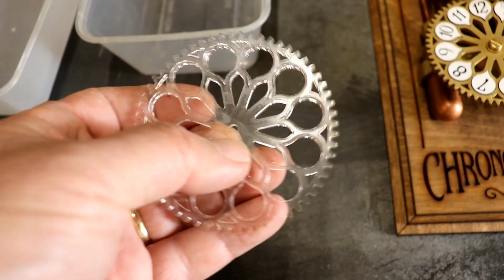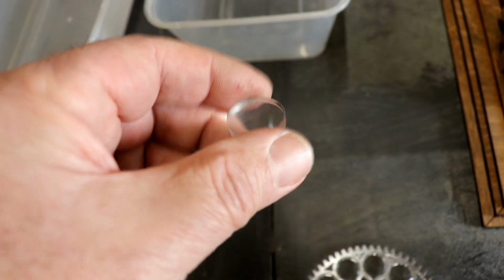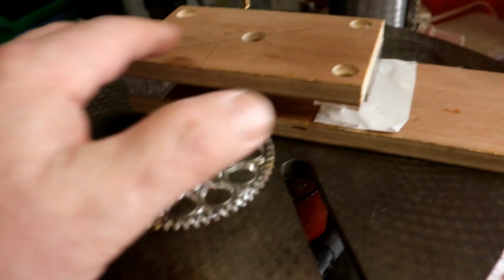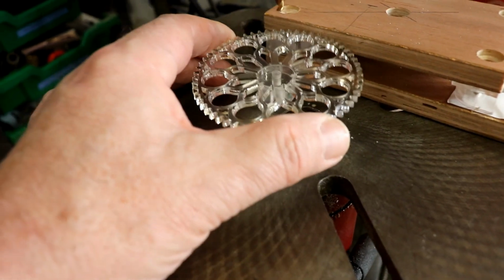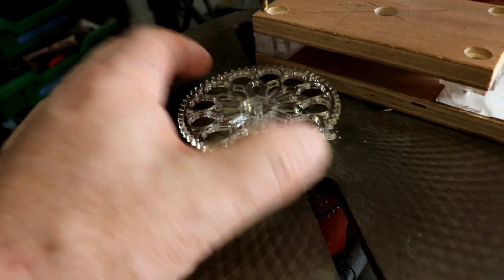So then I thought how to get this back bit that needs supporting. So this isn't actually, but imagine that's 10mm thick. So I cut out a disc 10mm thick and glue it roughly onto the back. Initially I held this down and drilled it, and then each one would suddenly snatch up as the drill went through, spin it round and make the hole all wonky.